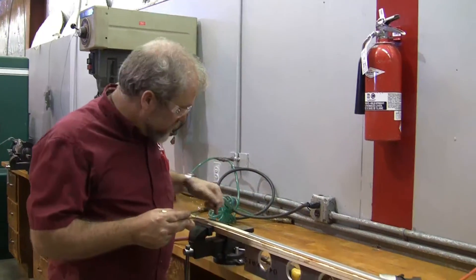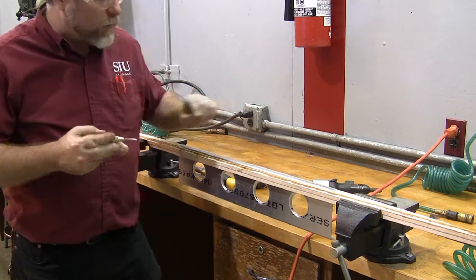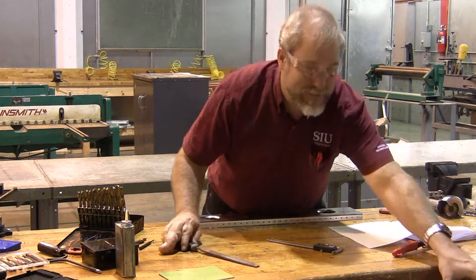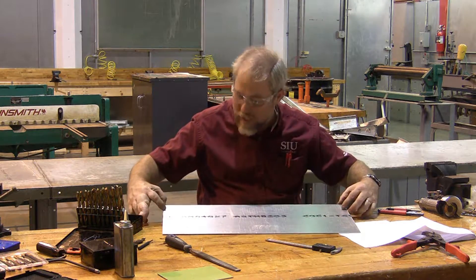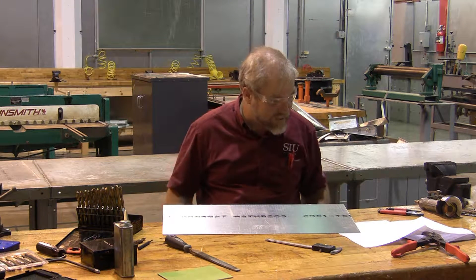The easiest way I've found to drill this is to mount it in a pair of vices so that our workpiece is supported. Since this is 24 inches wide and these need to be 11 and a quarter inches wide, we're going to make one angle piece and then cut it in half — that gives us enough to repair both sides.